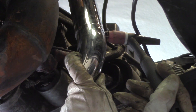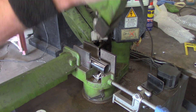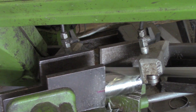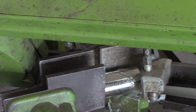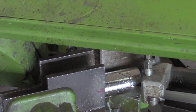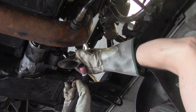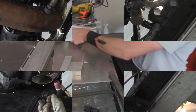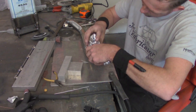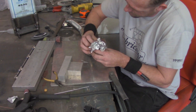That's just inviting disaster. The piece that we do have left is just the right angle and we're going to tack it on there. Still, even at that angle, I'd still like to not blow it right at the starter, so we're going to divert it around the starter as much as possible. I'm going to make this big old giant baloney cut here. The reason for the angle on it is so that it doesn't come in contact with the ground or the curb or anything like that — it actually stays tucked up underneath the subframe and the crossmember.